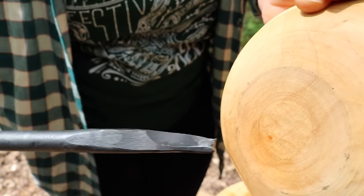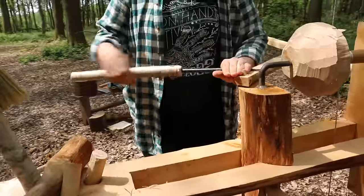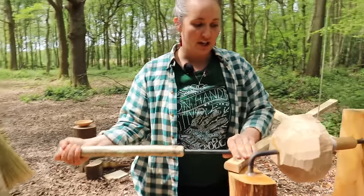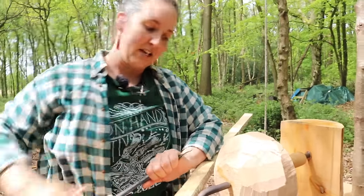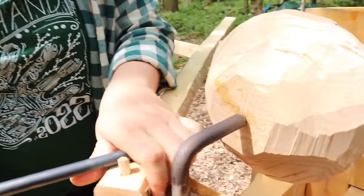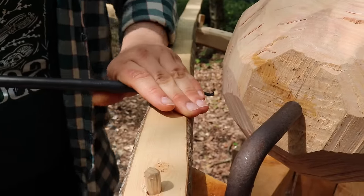So this is one way to explain it, and I'll say it a few different ways, but I wanted to show you on a finished bowl because it might be easier to see, less distracting with all the ridges and bumps. We'll see if that actually helps. When I'm applying my tool, I have to reference each face. A round thing can be made up of many lines all right next to each other, and each one of those I think of as the face. So how I apply my tool on the bottom of the bowl versus on the side of the bowl, I'm following this shape. If you think of the back of the tool here, it's more or less referencing the shape of the bowl, okay?